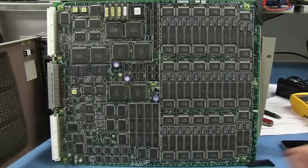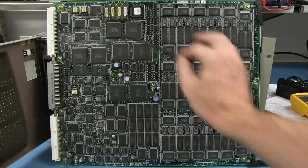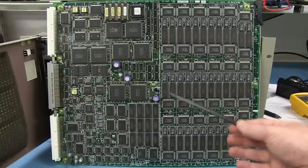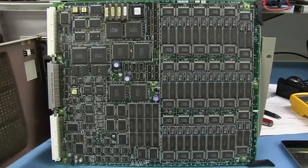So you might start off with a floor plan layout where you don't worry about routing, you just throw down the chips, maybe group them into sections, and see that it's all going to fit on the board. And if it doesn't, you might have to plead your case for a double-sided loaded board, for example. But in this case, they got away with it. Lots of stuff, very high density. You might have said, we're going to shoot for a six-layer board, but then gone, sorry, we need eight layers to get the routing density required. I don't know. This one's probably a six-layer board.